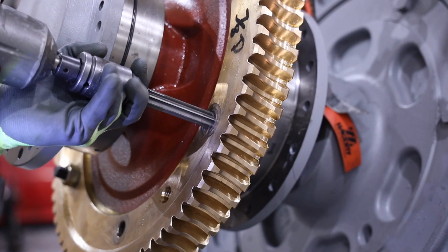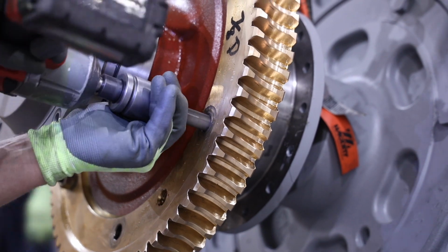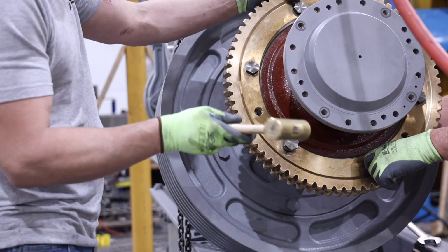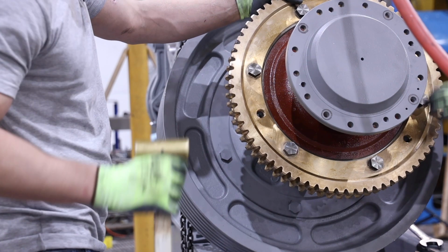Mounting of the gear can be resumed if the gear has adequately cooled. Ream the 4 body bolt holes through the gear and gear hub that do not have the temporary clamping hardware installed. Install the 4 new body bolts in these 4 holes, so the nut is facing towards the traction wheel. Tapping the body bolts to install them with a soft hammer may be necessary.